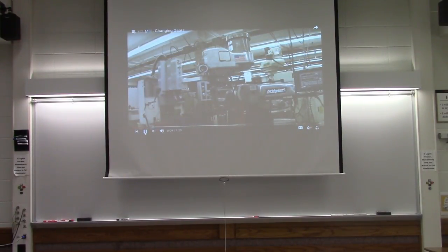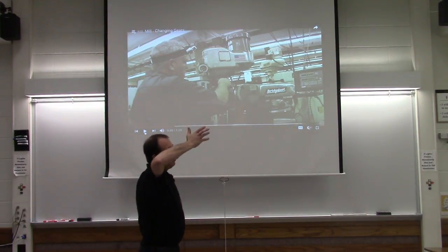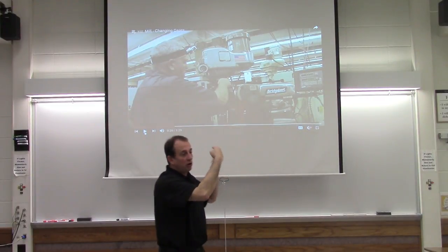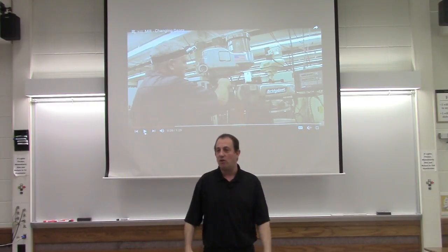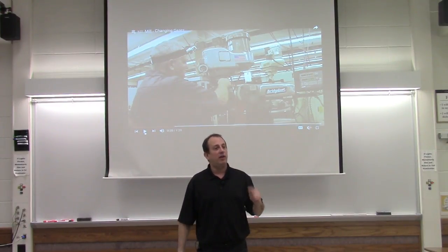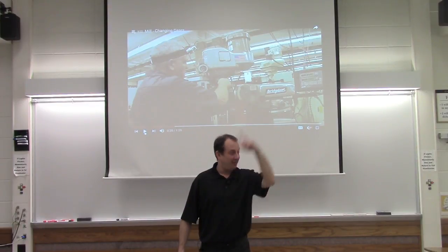This video will demonstrate changing gears in the Bridgeport mill. The Bridgeport mill has two speeds: a high and a low range. To change from high to low, the gear change lever is depressed and swung - there's a little pin, push it in, it's got some tension, just push it away and it'll snap in. When you go from low to high, push it in and it will snap in, grab the spindle and turn it - you will hear a click. If you do not hear a click and you turn it on, everyone in the shop will know it - it will grind. Let's see if we can make a semester where nobody grinds the back gears - usually somebody in this class will do it.